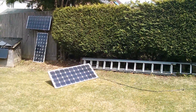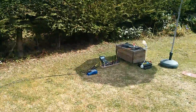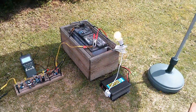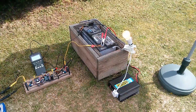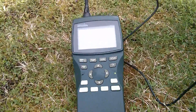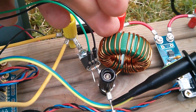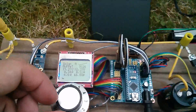Morning all. I'm in the garden today because we have a very rare sunny day. 80 watt solar panel connected to my maximum power point tracking test rig. There's also a 100 watt bulb on the battery there just to hold the voltage down so it can never go over a safe voltage. On the test rig I've got my outdoor scope — the one you can see the display on in sunlight. I've also got the new bigger inductor with a very large ferrite core. I found some thick enamel copper wire and wound that inductor, and it all works.